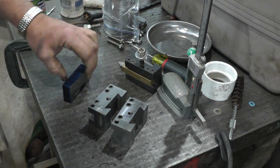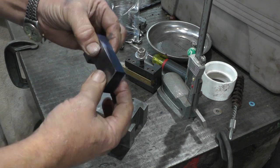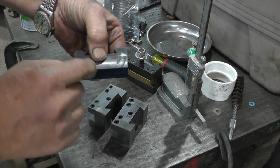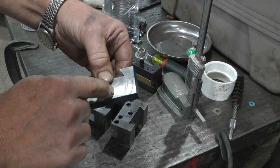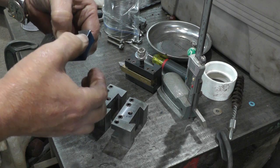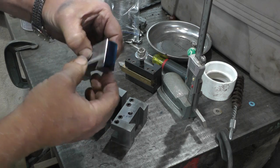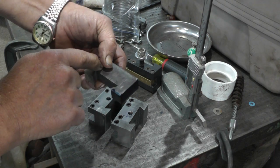And I decided that this little guy, I'm not sure this is going to have enough width this way to be real supportive, but I'm going to give it a shot. I'm going to drill in half inch on this side and 3/8 on this side. I got some boring bars, which I use on the lathe, which I also use on my boring head, and I think they'll work in there, and I can just have the set screws along here. So half inch on one end, 3/8 on the other,